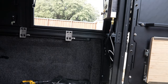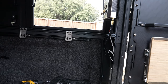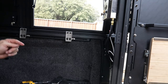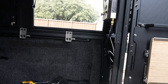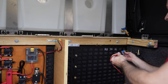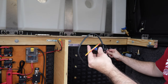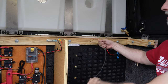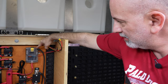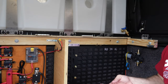If we hang the hot water heater on the back panel and put a cover or hard case over it, then all we need to do is connect a hose from the water spigot through the hot water heater and out to either the shower or the sink. The plan to power the pump is to connect it to an on/off switch wired all the way into the fuse panel, matching a fuse and a ground, so I can just reach in and turn the pump on and off as needed.